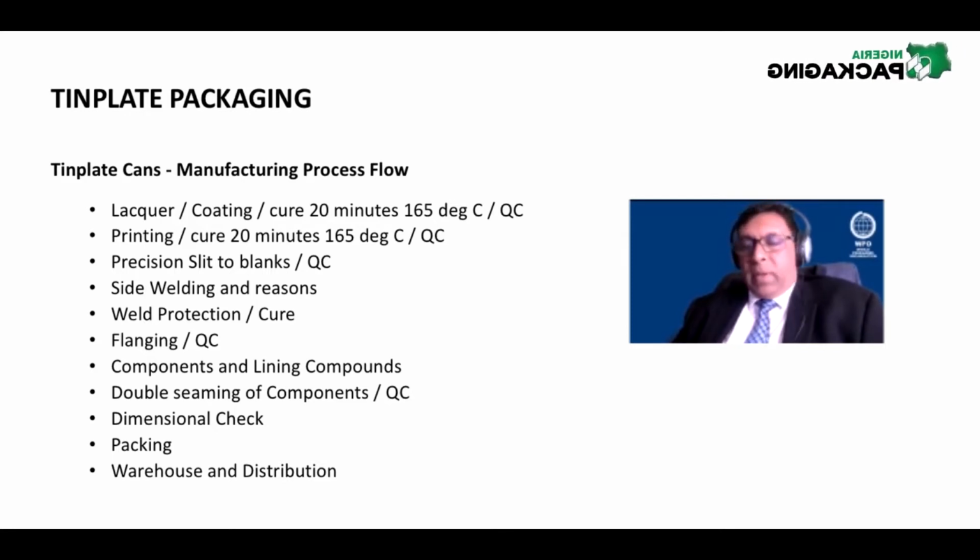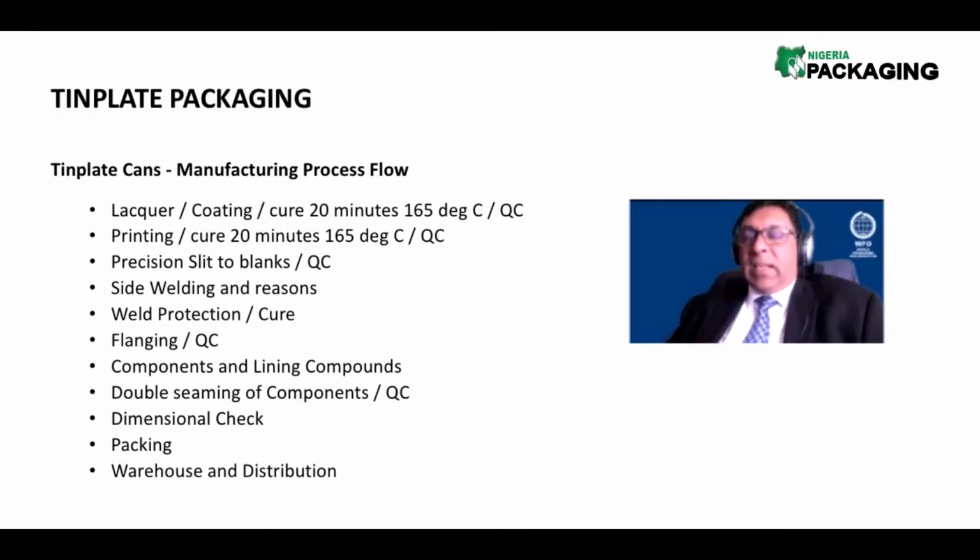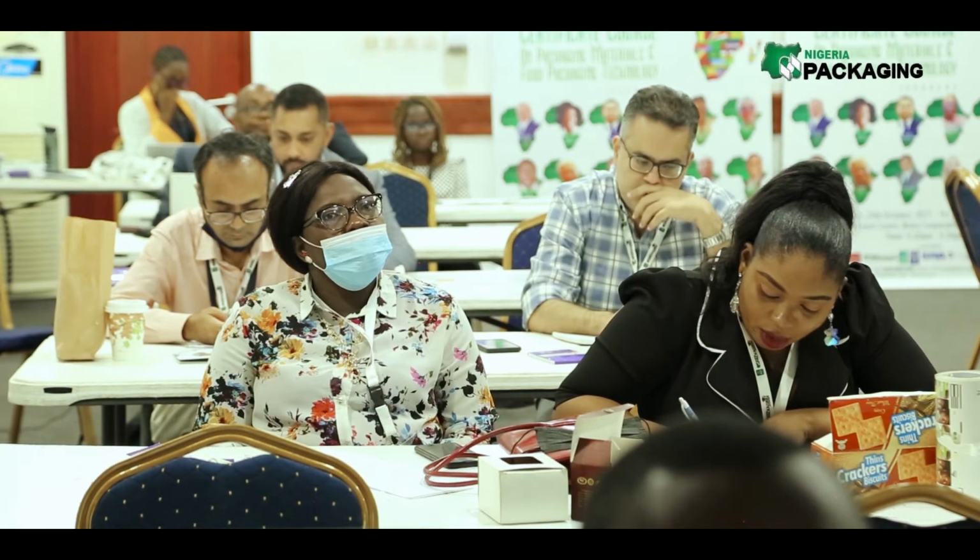How do we do that? We dip the steel, which is black, into a pool, literally like a swimming pool of stannic chloride solution, and we draw it out on the other end. But by the way, this is done before the sheeting. So it's unwound from one coil and it is rewound after it gets through the pool. But what happens in the pool? We apply an electric current and we deposit the Sn2+ onto the surface of the negatively charged steel. And we get a deposition of tin, which is Sn, onto the steel. Therefore, the tin plate is now looking silver.